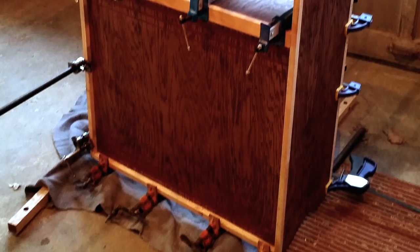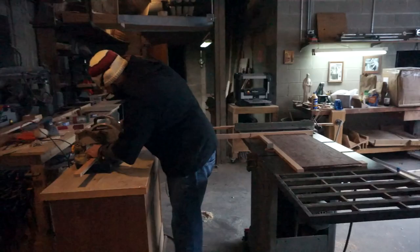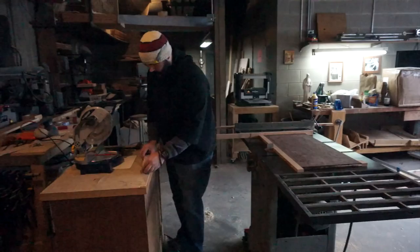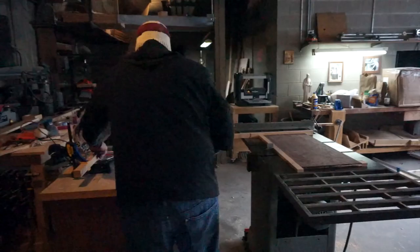The top of the cabinet is also getting some trim, but it's wider at an inch and a half. Because of the design that's on the top, I also thought it'd look better if I didn't use a traditional miter cut, so I have the ends butted up against each other so that the end grain is visible. I actually found it easier when doing the measuring for the lengths here, because I could just use a piece of scrap material as a placeholder and then get very accurate cuts.